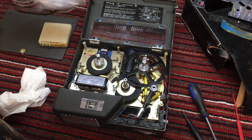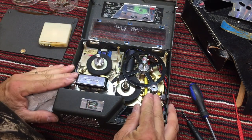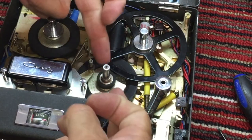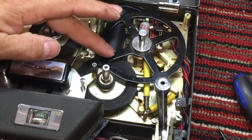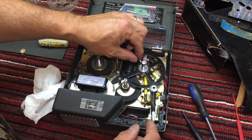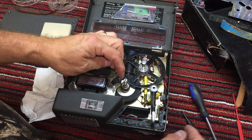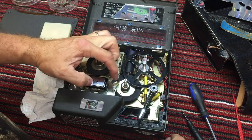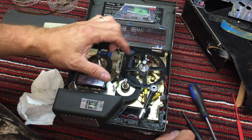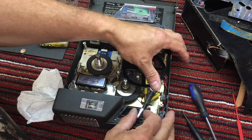All right, so we're in the stop position right now. So if we go into play, this should engage the capstan, and it does. And this drops down and engages this rubber wheel for take up. Okay, and there's a little bit of friction there. So the take up reel will turn and turn this, but not enough to pull it. We don't want the tape to be pulled by anything other than the connection between the pinch roller and the capstan. So this should be just enough pressure to pull the tape or take up the slack on the reel. So let's go back to play again